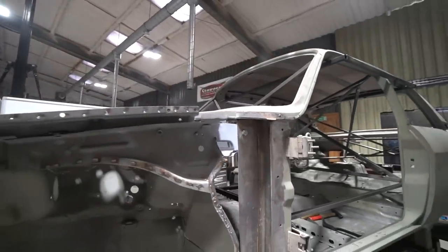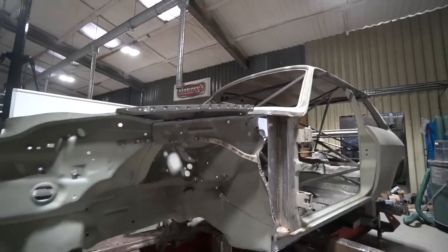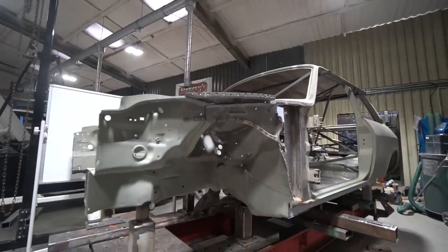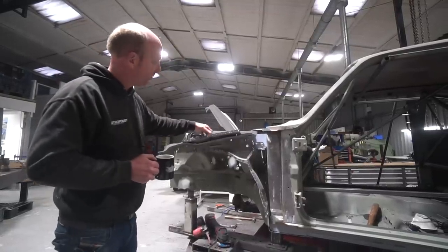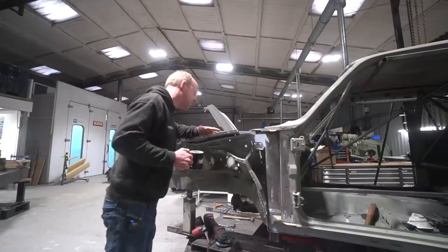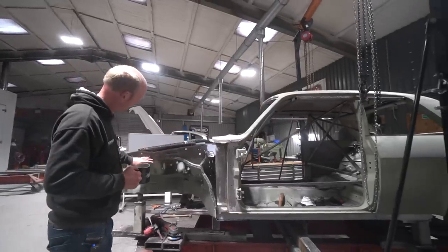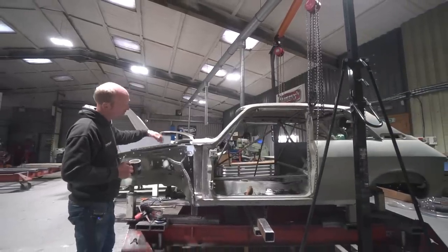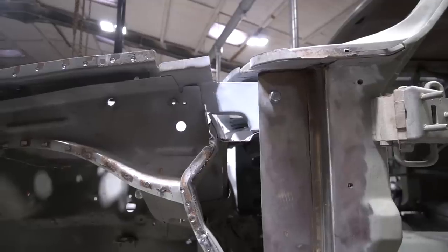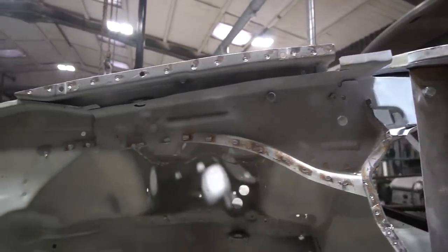This section here will need to be remade to a new line - that's the original Integra wing mounting rail, which is obviously the wrong profile. Surprisingly close to the right profile, but not quite - the Allegro bonnet actually sits a little bit higher. Once that's all done, we'll remake the inner wing top rail, which is a separate spot-welded-on section. I presume Honda used the same underlying pressings on other cars and changed the top pressing to suit the DC2 body shell. That pressing will be removed and we'll make a new pressing to replace it, which will give us the joint to our new carbon wings and carbon front end parts.